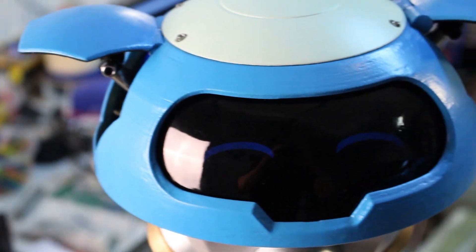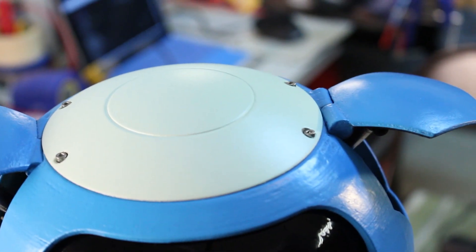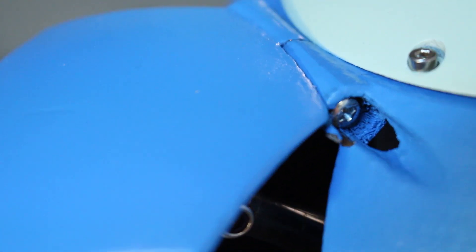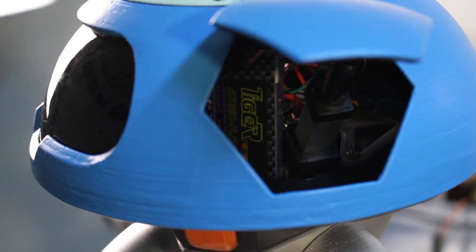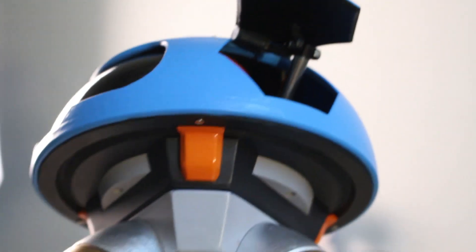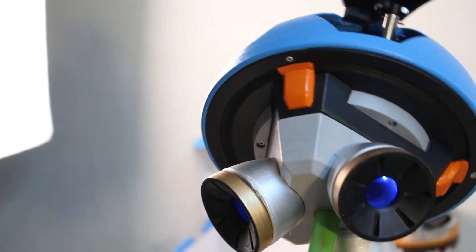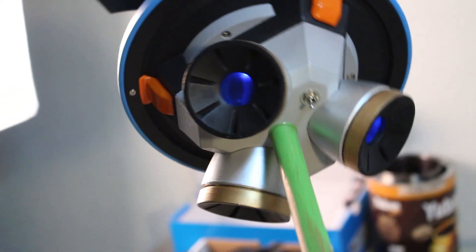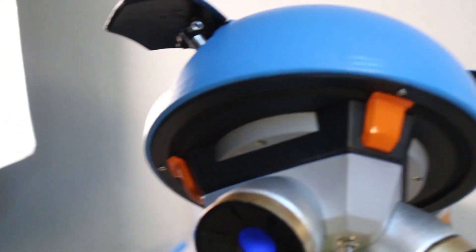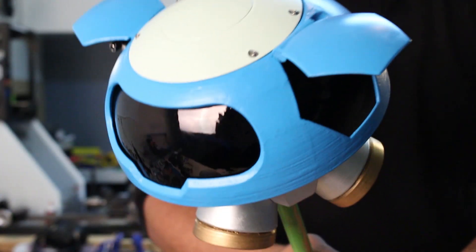One of the ears is misaligned so it is slowly breaking apart. Snowball is powered from a single 3-cell RC lithium battery. The body is held together with a few small screws and a lot of glue. There aren't screws aside from the head in the character model, but I needed a way to easily take Snowball apart. Power is switched from a toggle in the bottom that is mostly hidden by the thrusters. I also added a standard 1/4-20 nut so that Snowball could be mounted to an armature or a regular camera tripod.